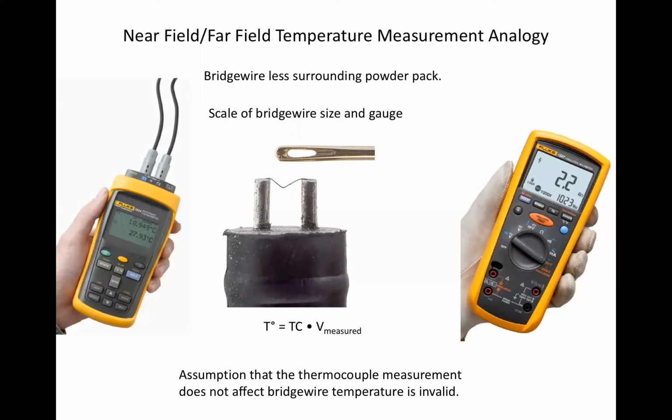Attaching a thermocouple lead to the bridge wire increases its thermal mass significantly. Thus, for a given current passing through the bridge wire, more heat may actually be dissipated, but at a lower temperature. Attaching a thermocouple eliminates the possibility of measuring the true temperature rise in the bridge wire alone due to current passing through it. But a relative measurement is still possible. That is, we can measure the temperature rise due to the no-fire direct current, or 16.5 or 20 dB below the no-fire direct current, and then measure the temperature increase from any RF currents induced in the bridge wire.